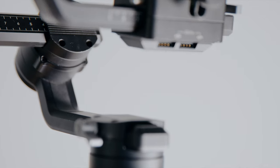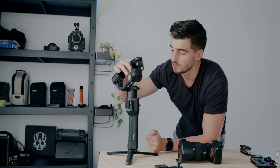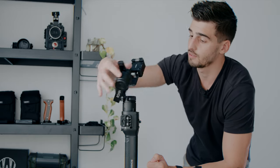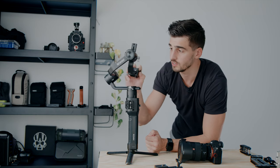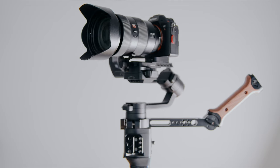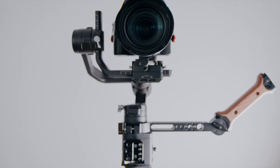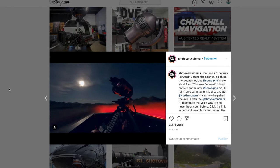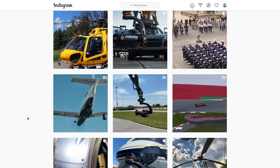There are a few cool tricks and functions that the gimbal can do. At the top is the stabilization unit. On most gimbals we have three motors — one, two, and three — controlling all three axes. That one controls your tilt, that one controls your roll, and that one controls the rotation around the main axis. Most gimbals only have three axes. The only time you see more axes is on stabilization systems like those big balls at the front of helicopters — Shotover uses those, which have five or six axes. So it's a gimbal within a gimbal.